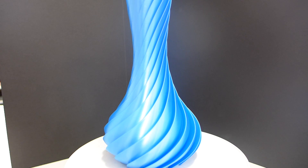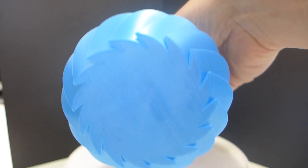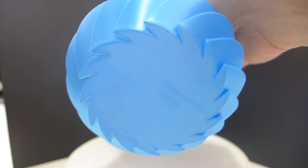Here's another awesome spiral vase — it's a little big, but it came out absolutely gorgeous. No issues anywhere, no under-extrusions. When it's printed in one solid line all the way through, you can't see any layer changes. It just looks super professional. The bottoms on these came out well — I had them squished down. You definitely have to squish this filament down just a little bit more than usual, but there are no issues with this at all.